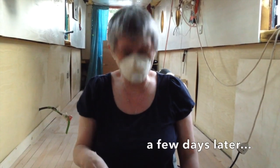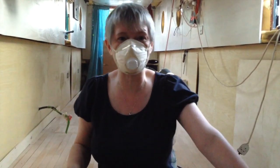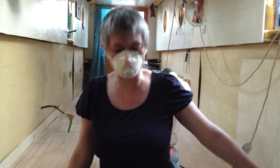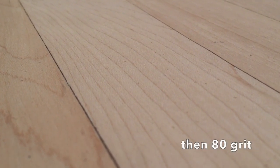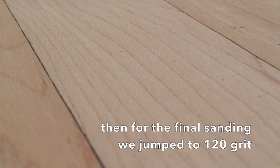I'm sanding our floor. I'm going to see what the difference is between 80 grit and 120 grit and see if I can see where it changes and if it makes any difference whatsoever. This looks cleaner, but I'll just see. Okay. Oh, wow. There. That's the transition. That's where you started, wasn't it? Yeah, I started in the middle and went. That is still really rough, and you can see it's soft. Proper soft. And this is a sharper grain by far.